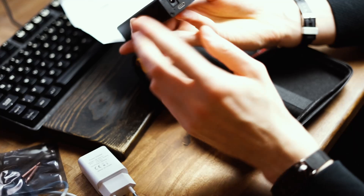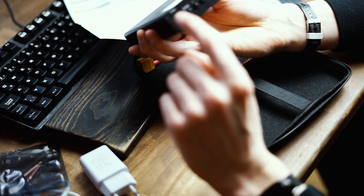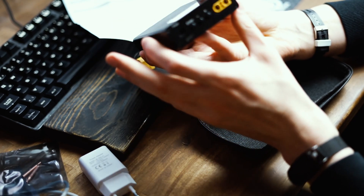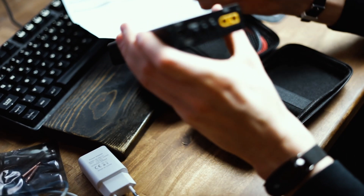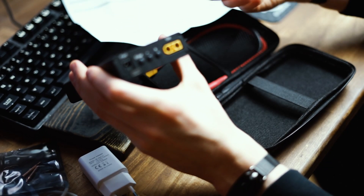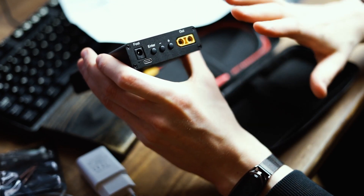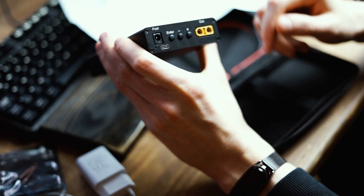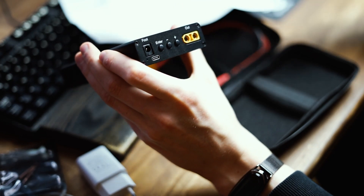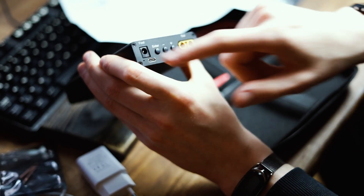While the spot welder has a foot pedal input, it doesn't come with a foot pedal. You can buy one extra and add it, and I think that would be worth trying out. But it mainly works on automatic mode where, as soon as you put down the electrodes, it detects that you want to weld and initiates the weld. I think as long as you're careful, the automatic mode works perfectly. But if you want a two-step verification process where you're using your foot to actually weld, the foot pedal is a nice add-on.